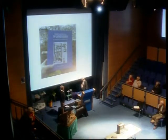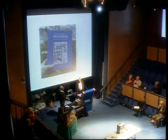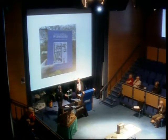When you make models of 18th century engines which are atmospheric, they are so inefficient at a model size, you just cannot get them to work. If you want them to be authentic in appearance, they would have to be a much greater scale than I've made them at, and I wanted to make them exactly how they were. They do go through all the motions exactly as they would have done, but powered by compressed air or a vacuum. But you can't get an atmospheric engine to reliably steam. And when you've gone to so much trouble, would you really want to throw oil and water all over that?